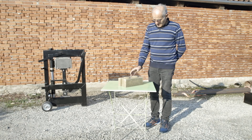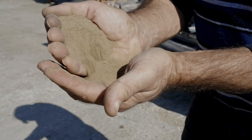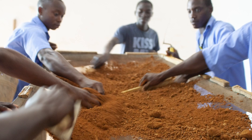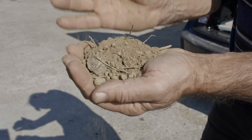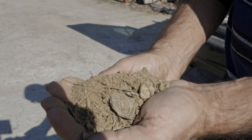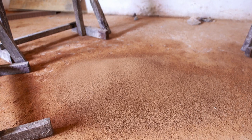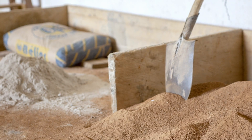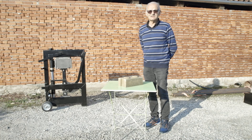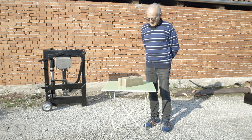In order to obtain this block, perfectly dry soil is needed. Moreover, the soil must be sieved to remove any organic material, roots, stones, gravel, and so on. A small amount of cement should be mixed with the earth; the quantity of cement may vary between 6 and 12%.